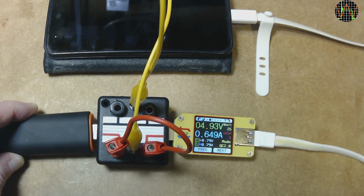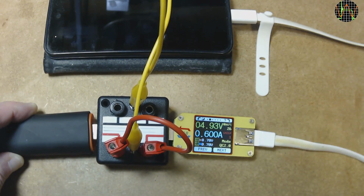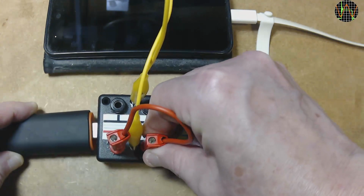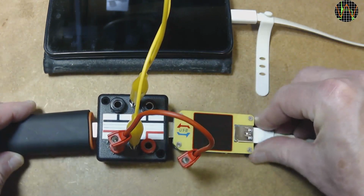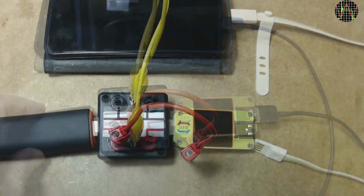I don't believe there's actually a real change in the charge protocol here. It's just the USB tester trying to make sense of the D+ and D- lines. It seems that the Wily Fox Swift doesn't care about the D+ and D- in any case and simply draws whatever current it needs. They get away with it since that current is barely above the 500 milliamp limit set in the dawn of USB, and pretty much any decent USB port these days can deliver more.